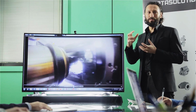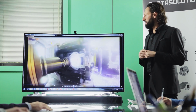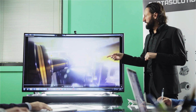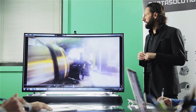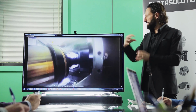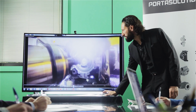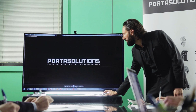precision between the machining, instead of doing operation 10 and operation 20, which always lose something, talking about tolerances, because in this part we have a lot of CP and CPK values. It was a really nice application. So we clamp once, we machine index 0.90, and once it's unclamped, the part is finished. So this gives, again, more flexibility.